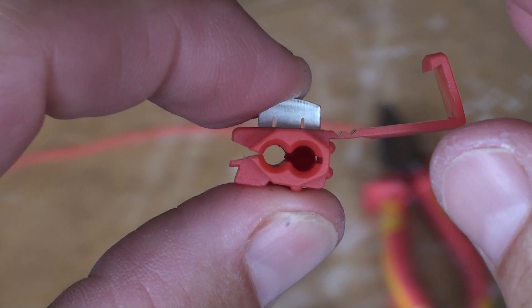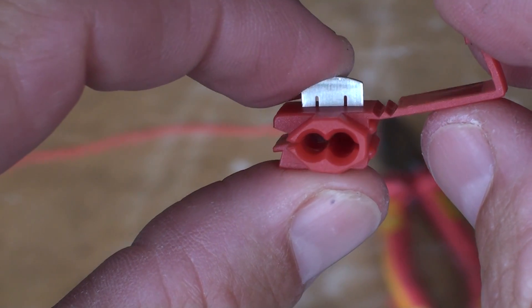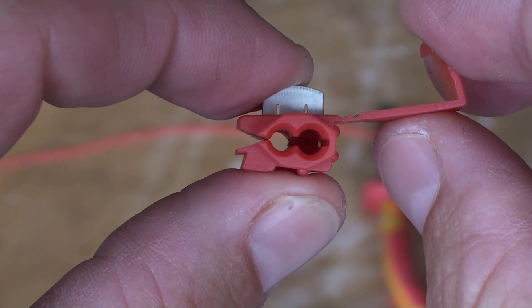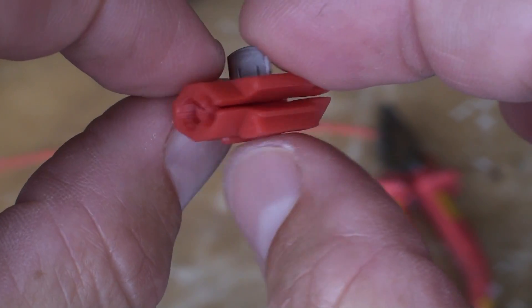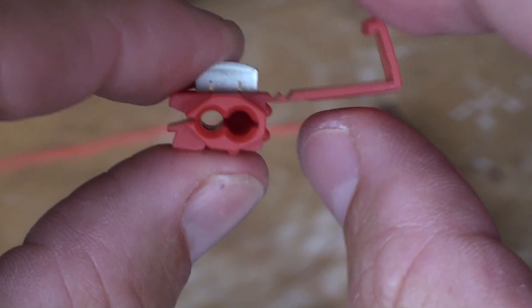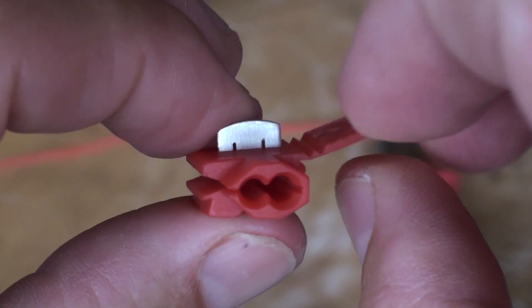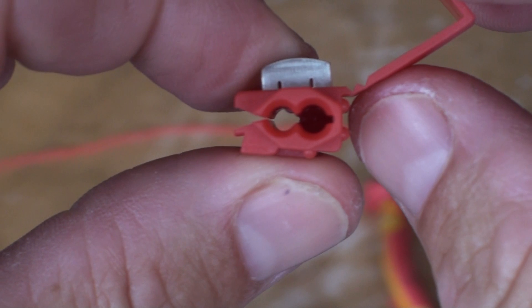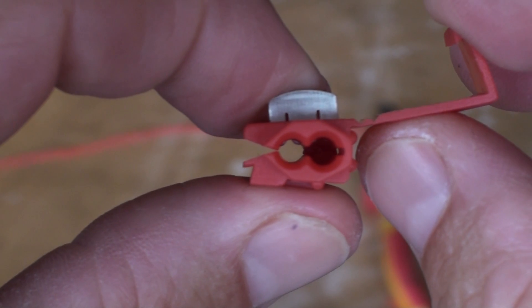Okay guys, these are the suitcase clips. Basically the hole you can see going straight through — that'll be the bus wire, or the power where you're getting your signal from. If you turn it around you'll see that on the other side it's blocked off. You can drill that out and run two wires out of there, or if you just leave it as is you poke one in there. When you close down this clasp and lock that over the top, the little grooves in there will hit the copper and give you a connection from one to the other. That's a really quick and easy way of doing things.